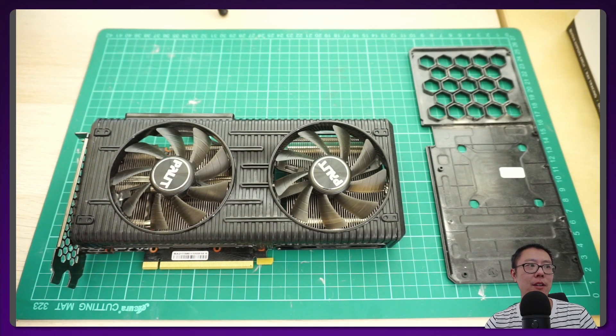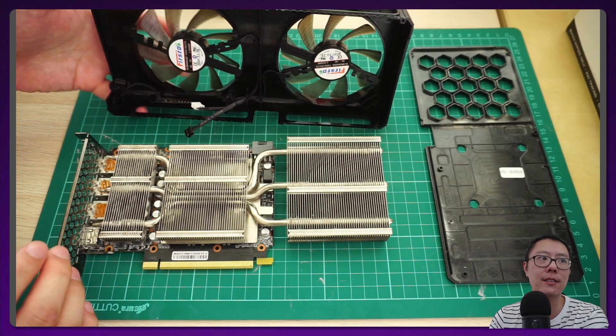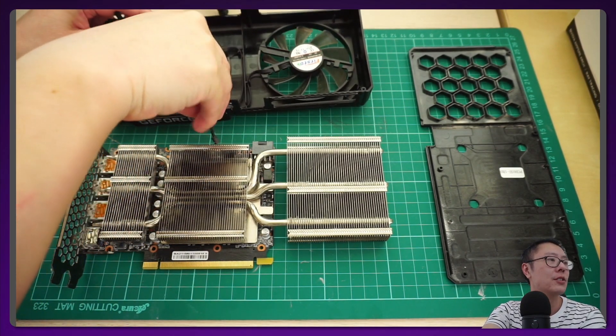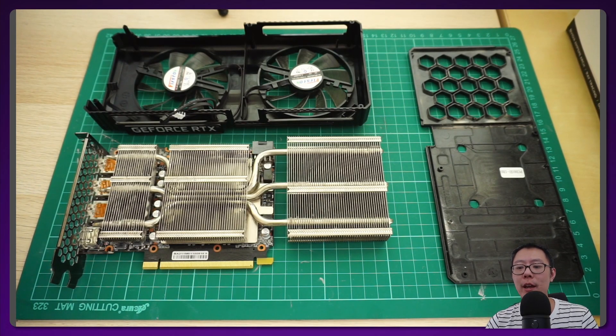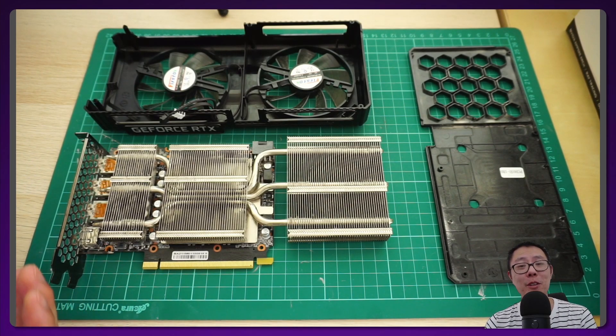So if you're in the same situation, my advice is to just leave the fan header alone if it's too hard to remove. Just do the thermal pad swap with the fan cable still attached — I did exactly this with my Palit RTX 3080 and it was perfectly fine. Don't try to force it out if you can't get it out. I'm putting the fan shroud back on the card as is, and if this video is up on YouTube, you'll know my RTX 3060 is working fine. If you liked this video, hit like and subscribe for more videos like this.